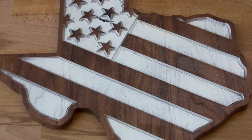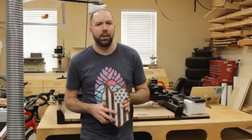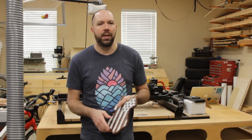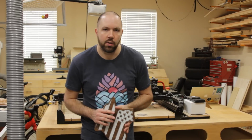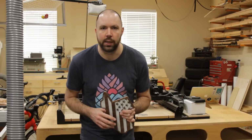With that said, the 1/16 inch bit, for some reason, I still can't figure out why, actually cut a little bit deeper than the 1/8 inch bit in the roughing pass itself. I'm not sure why that happened. I ran the Z-Probe a second time before starting the detail pass. So I'm thinking it's either something along the lines of the work area itself is not flattened, or the piece I was using wasn't exactly flat, maybe it had a bow in it or something like that.